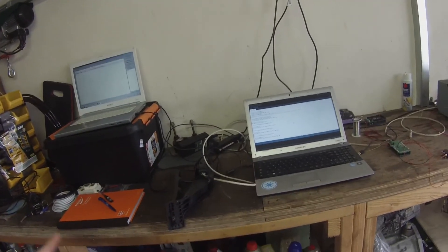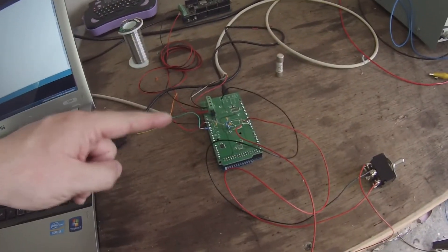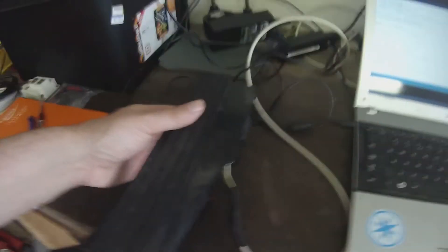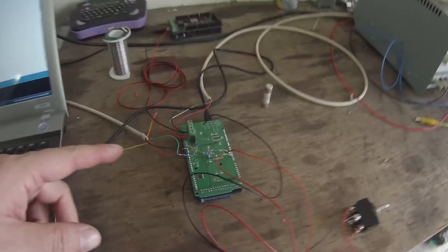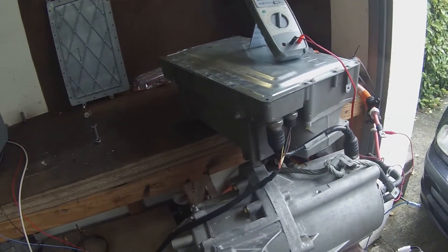We're back here with our two laptops. This one is where I've been writing the Arduino program to send to this Arduino here, which is quite a mess at the minute. It has a CAN transceiver on board, and I've rigged up some components including a BMW E90 Hall Effect throttle pedal. We're taking one of the sensors from that, feeding it to an analog input on the Arduino, and using that to create a CAN message that we send through this wire — the CAN bus — into our inverter to ultimately spin the motor.